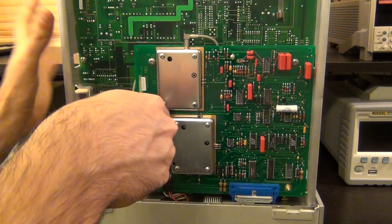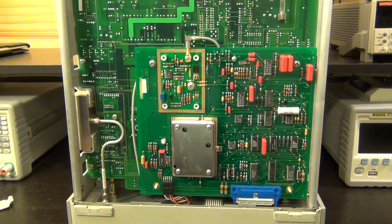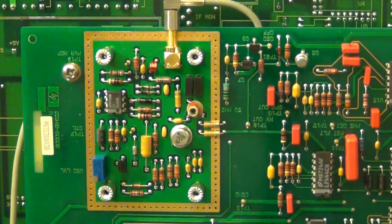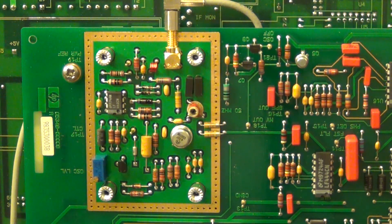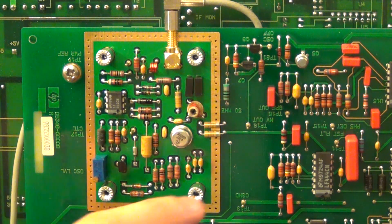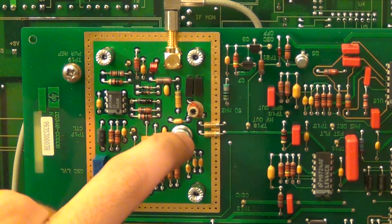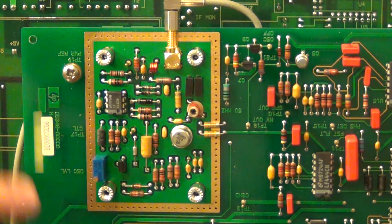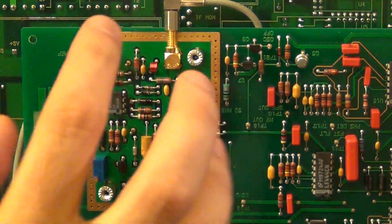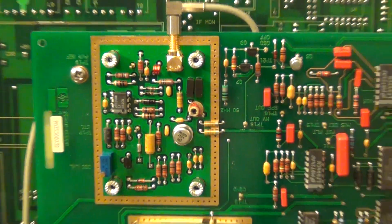Just for fun, let me take these screws off. There we go, I took the can off. Just to note: everything on this board is through-hole — all the boards. There are no surface mount components, so it's really easy to repair. It's pretty impressive what this thing can do given its age. I've labeled a couple of places: this potentiometer here is supposed to control the oscillator level, and there's '50 MHz' written there — as I said, this is the 50 MHz tone. There's either a transistor or a hybrid amplifier in here. They put it in a can to ensure it doesn't radiate out and that it's clean and exactly one milliwatt. The only thing they need to ensure is that the frequency and power are correct, because if this is not one milliwatt, then everything you measure with respect to it will be wrong.